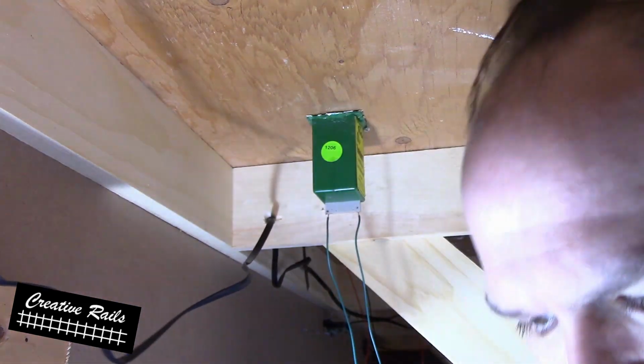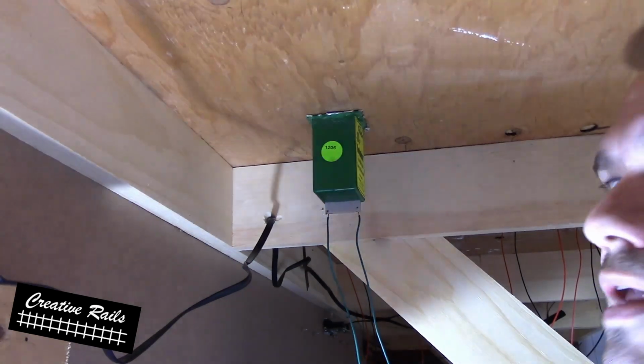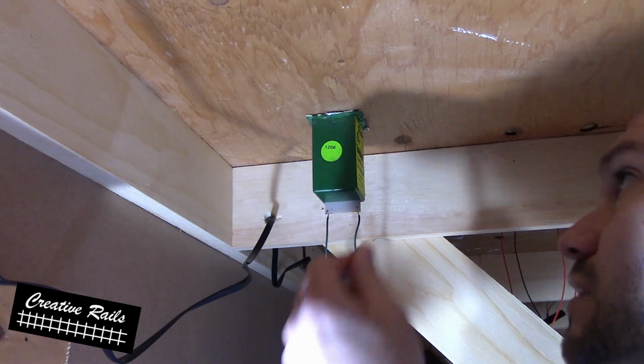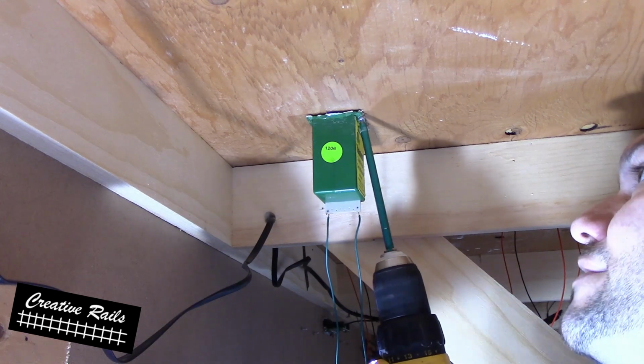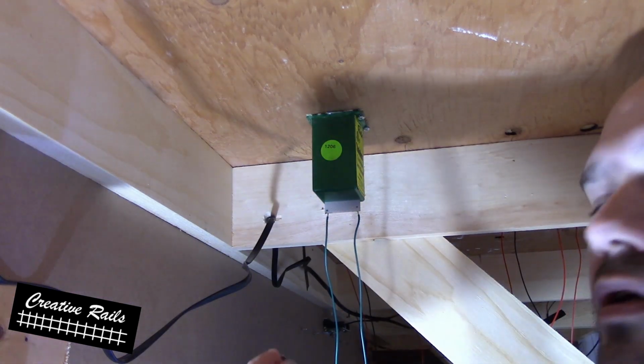Our second one. Now this is why I get asked a lot, especially in the construction industry, why I like normal drills and not impacts. Well, this is why. When you're doing doors and stuff, impacts are notorious for stripping screws, breaking things. That's why I still like the old-fashioned normal drill, just like this.